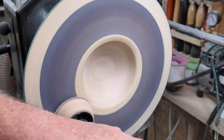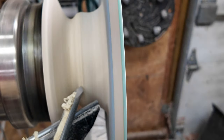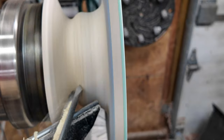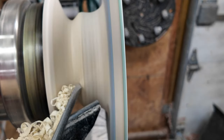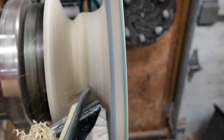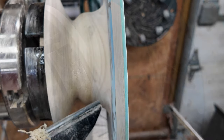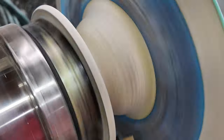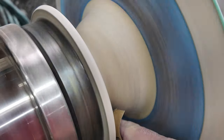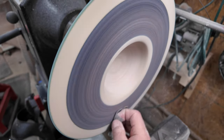So you saw there the blue going on, and you also saw there that the blue disappeared. Well, that's because I removed it after nearly a day and a half of curing and problems of trying to have the two materials gel together. So moral of the story, do not use acrylic waterproof paint and expect the epoxy to marry to it, because the two are alien chemicals, and they react to each other. The bubbles were just an enormous mess.